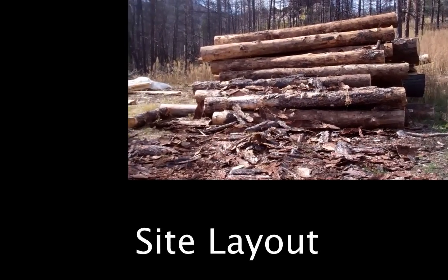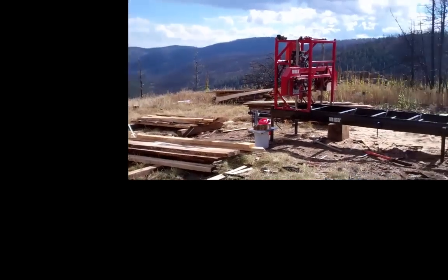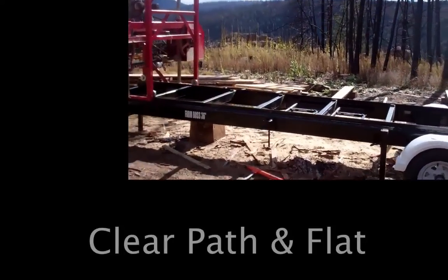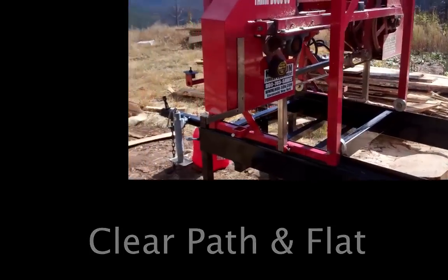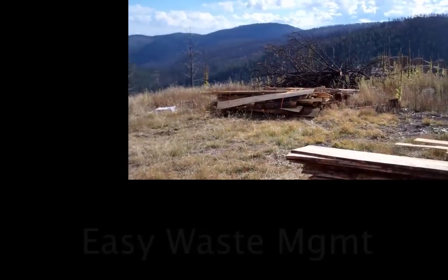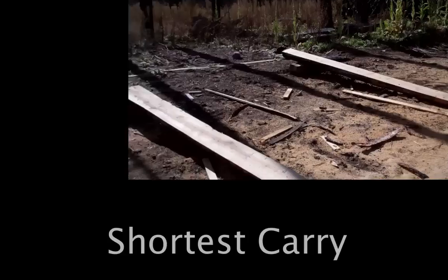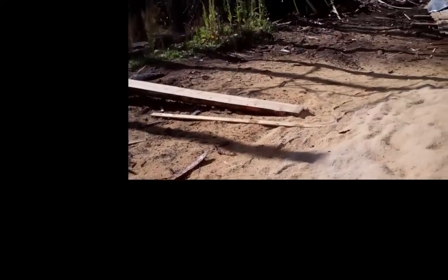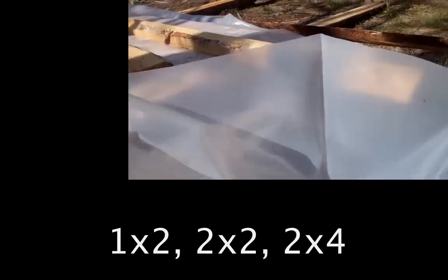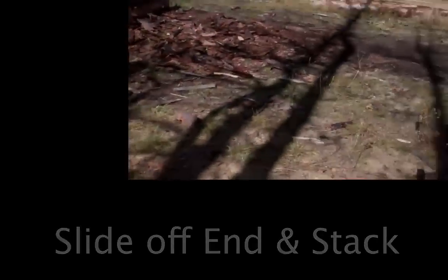The second part is actually laying out your workspace. In this case we've got a pile of logs, our sawmill, and then various stacks for storing our product as we go through the process. The logs move from the log stack to the sawmill. The first thing that happens when you make your first cut is you create a bark slab that goes off the end of the sawmill to a set of skids. If you gather these and bundle them, you can store them to the side and they stay well behaved. The actual lumber goes on a set of skids to the side, depending on whether you're cutting two by fours or whatever — one or two piles depending. In this case we've got three different piles: one by twos, two by fours, and two by twos because I'm cutting two by lumber.